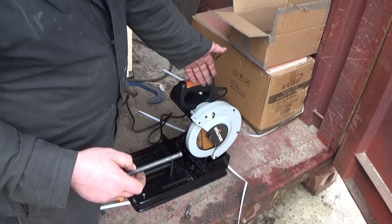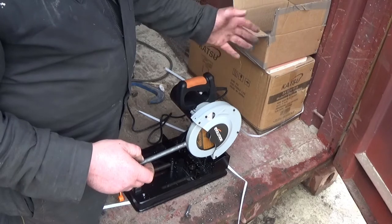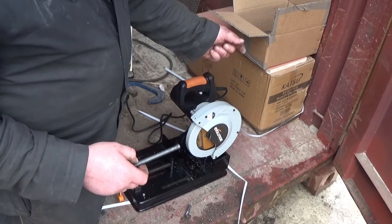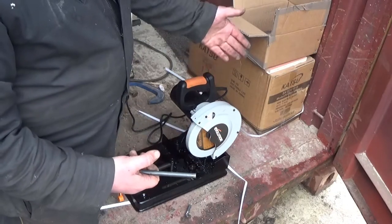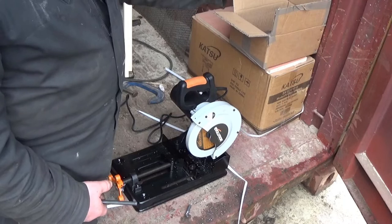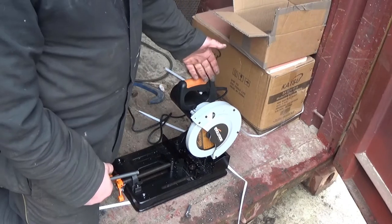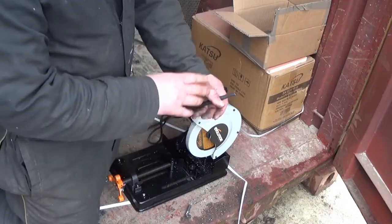The only reason these saws are possible, I suppose, like the old-fashioned saws you see in fabricators, they've got a big motor, a really high reduction gearbox, and then an HSS blade maybe, and maybe the new ones are carbide, but those saws only turn like 60 RPM. Maybe the blade's a bit bigger, so the tip speeds would be a little bit higher than this saw turning at 60 RPM. But then they've got a two foot handle on them, and you'll see blokes swinging on them, really putting some grunt into it, but they need cutting fluid, because high speed steel obviously needs to keep cool.